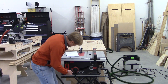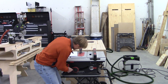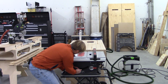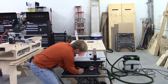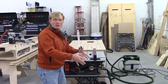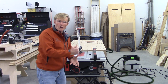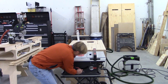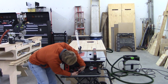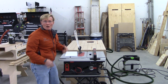Something I really like about the SawStop that the Bosch doesn't have: everything is balanced, so you're not lifting a bunch of weight. When you turn it, it's balanced and weighted, so wherever you stop it, it stays right there. There's also a disc you pull to tilt the blade, and wherever you stop it, it locks — you're not unlocking, flopping the motor around, repositioning, and re-locking like the Bosch 4000 was. As soon as you let go of the disc, it's balanced and it stays. There's a big arrow and a gauge, so when you're moving it, it's very easy to stop it right where you want, anywhere between the degree markings.